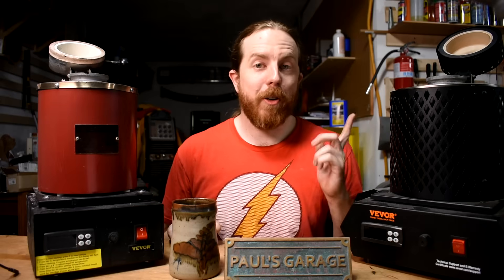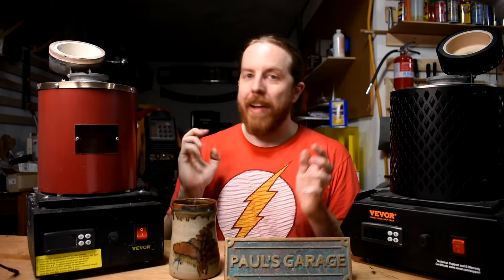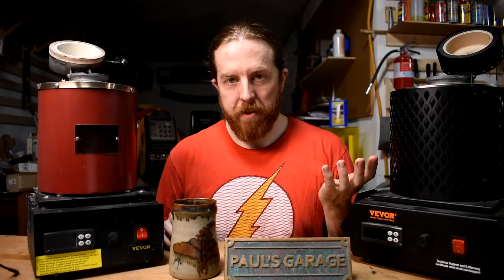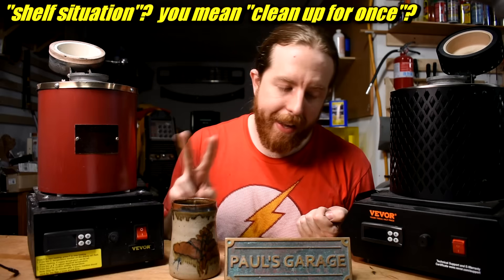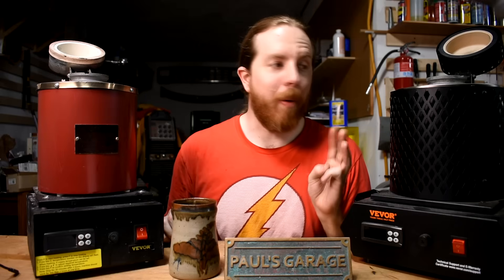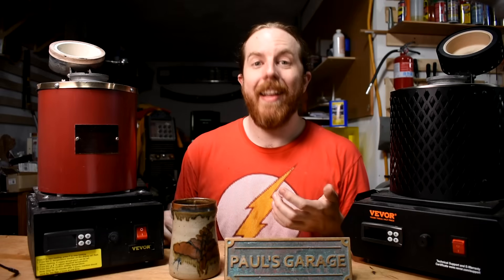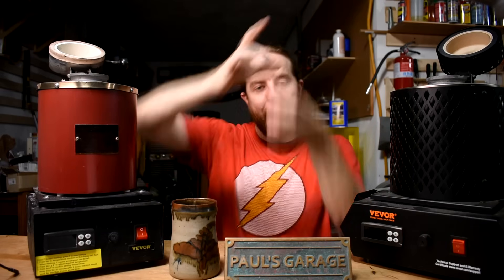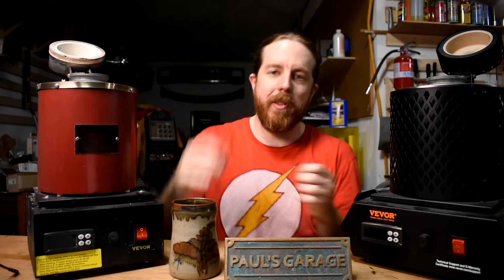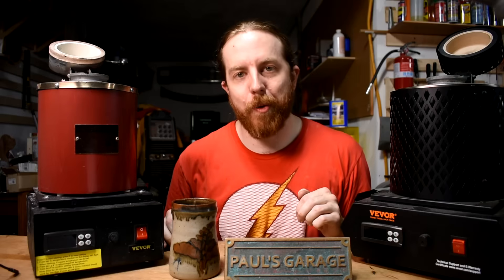A couple of things. First, keep the crucibles up off the floor, off the concrete, not knocking into each other — sitting somewhere they're not going to tip over or take any knocks. I'll have to arrange some kind of shelf situation in my garage. Second, don't be clumsy handling them. Third, don't overfill them. This bronze stuff is super heavy, and that's a lot of weight being held up by that top ring — red hot carbon holding the weight of all that molten bronze. There's probably a limit. I thought the limit was full to the brim. I might be wrong.